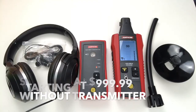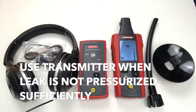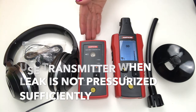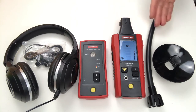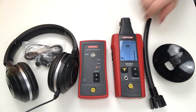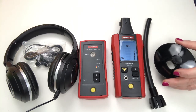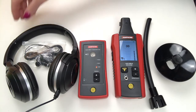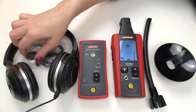the Amprobe ULD 400 series may be for you. The Amprobe ULD 420 ultrasonic leak detector kit includes an ultrasonic transmitter that outputs a signal the receiver will pick up, two attachments including a tube and a parabola that will help filter out background noise. In addition to visual confirmation that you've located the source of your leak, you'll get audible confirmation via headphones or earbuds.